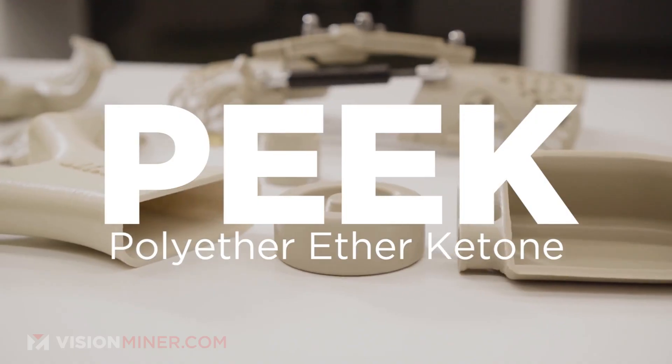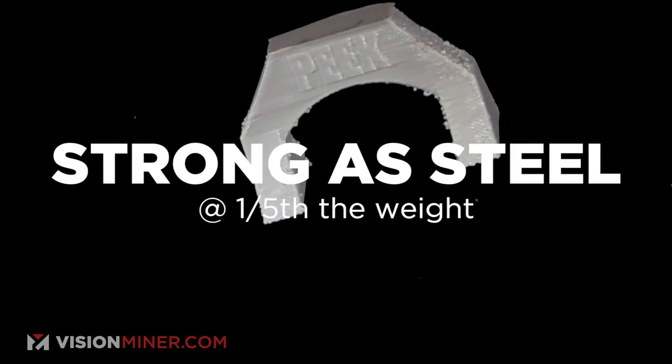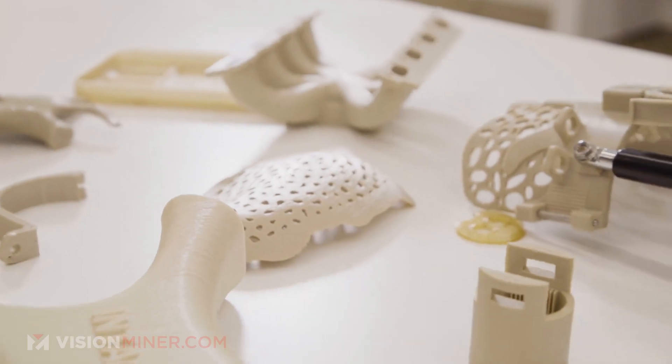Can you replace metal with plastic? Think about that. I don't see any way it's possible for a plastic to be as strong as a metal. A hundred percent infill PEEK may be, in certain axes. If you take PEEK, it's as strong as steel by volume. Now getting a piece of PEEK the same volume as steel — density — by weight, it's going to be way lighter.